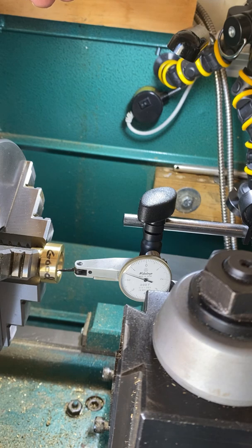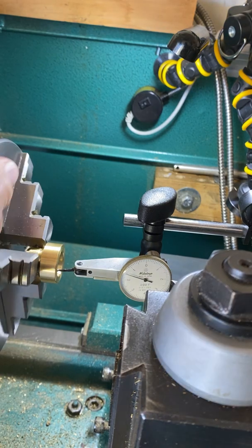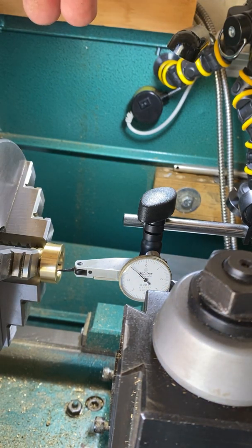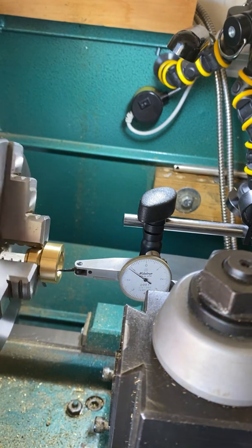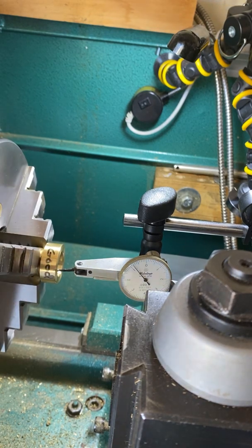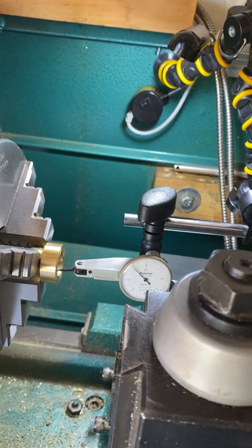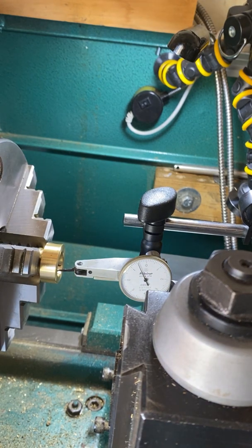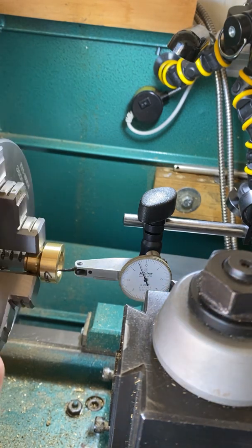So I'm going to tighten it up a little bit now. It's really important to do all three of the tightening spots — not just one. Hit them all about the same and get it not quite tight yet, because sometimes when you tighten it changes things. Look at that — one ten-thousandth of an inch concentricity. Now I can tighten it good and tight. For a mouthpiece you don't have to do super tight, just tight. That's an easy, good case scenario of getting a workpiece dialed into the chuck.